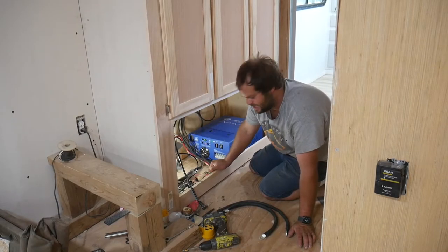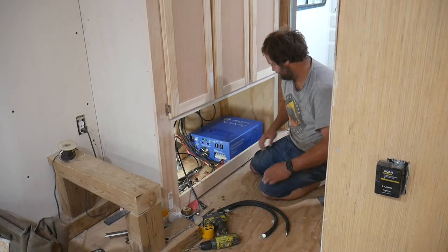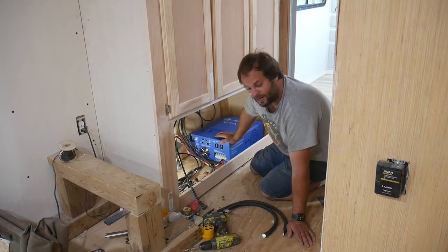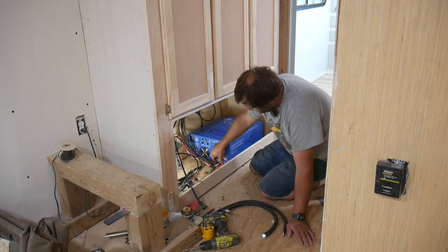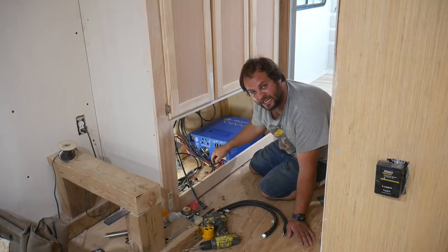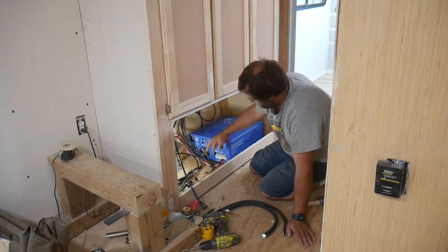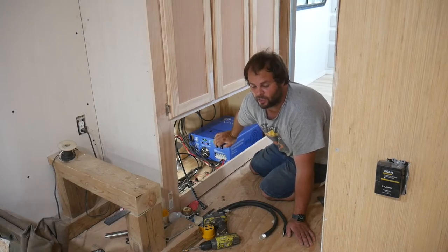All right, I hope you can kind of see what's going on here. I know I got the air conditioner blowing right on you. It's probably noisy. I got this thing stuffed in here. It was quite a pain. It's so heavy. I've got the high voltage hooked up. There's a neutral and the two legs, which normally would be 240 volts, are brought together and brought in the 120 volt side of the inverter. This is a 120 output only.